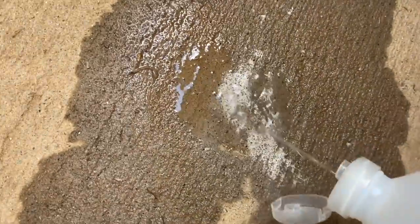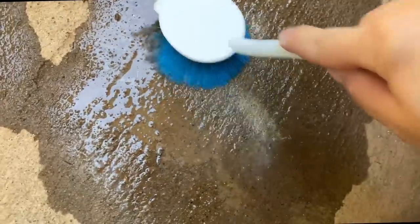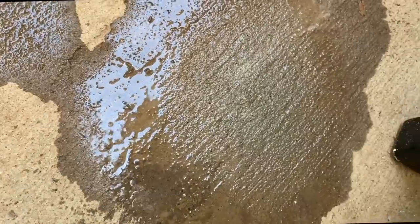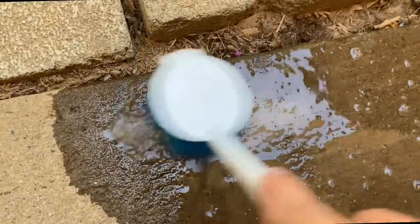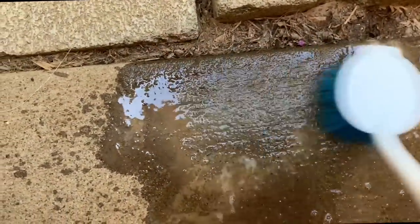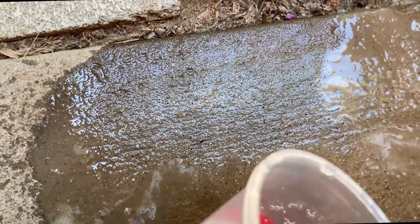We've all spilled paint on concrete. I like to use alcohol — it's quick and easy. I squirt it on, let it sit, then go in with a scrub brush. If it's not budging, you can add some acetone or fingernail polish remover for more dried-on stains, but most times alcohol does the trick. Rinse it away with water afterward — rinsing is really key — and use a washcloth to dab and remove the paint as you loosen it.